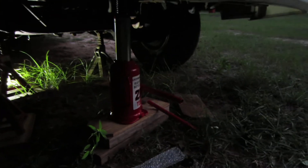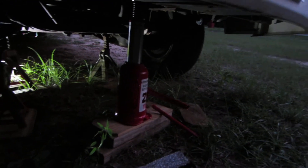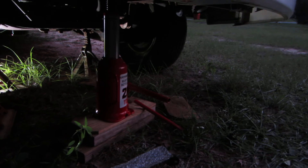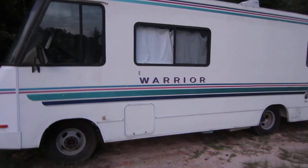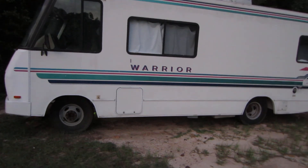Like and subscribe if you will — hope this video helps some people. Be safe. These things are super heavy. I've got a 20-ton jack under here, and if I were working on a heavier one I'd go with two 20-ton jacks and some real heavy-duty jack stands. These are regular automotive jack stands and the 20-ton jack worked really well. Look out for the other videos on the reinstall of the starter, and I'll probably do a video on the insides of that starter motor — take that motor apart. Have a great day.